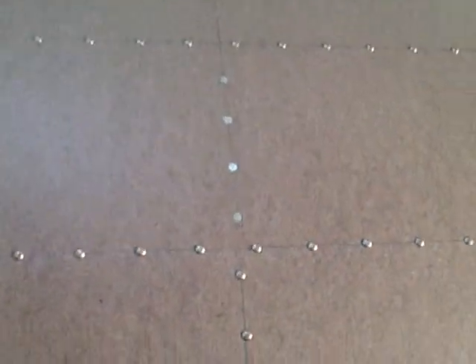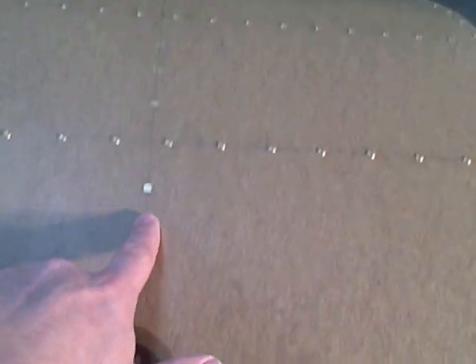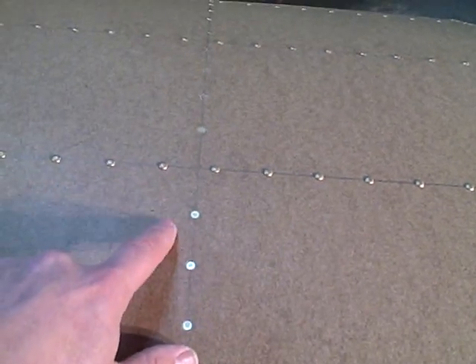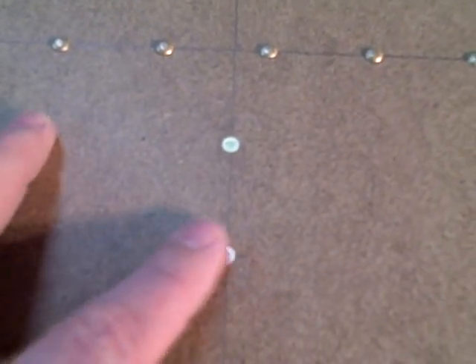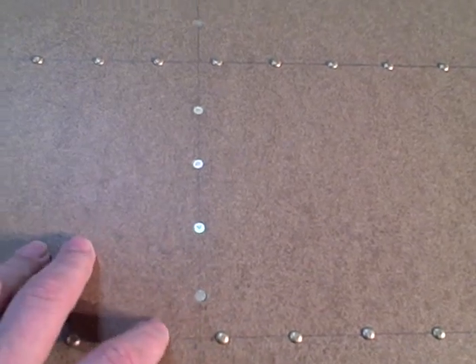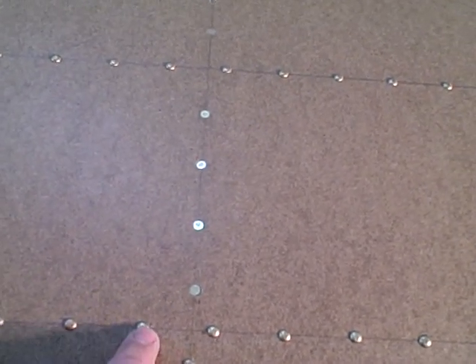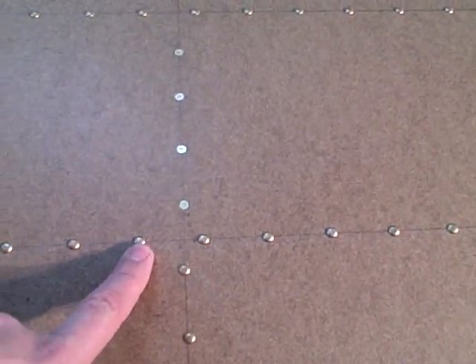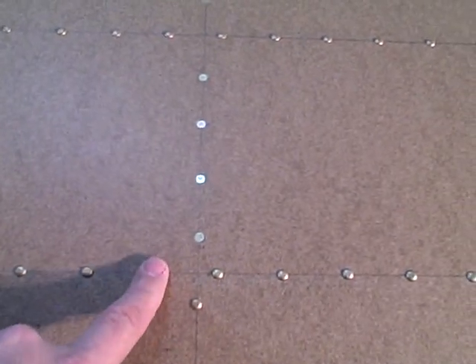This is the forward turtle deck that has been skinned with eighth-inch hardboard, and as you can see I've used actual aircraft rivets — these are standard aluminum rivets. I'm using flatheads here; they're flush with the surface. I didn't put very many in because the ones I had at the time didn't have long enough reach to go deep enough into the material to hold very well. The rest of the rivets are standard panhead rivets — half-inch rivets, eighth-inch diameter. The trick is you drill the hole just a little bit undersized, put a drop of glue in the hole, and tap it in with a hammer. It doesn't mar the surface and it looks really good.